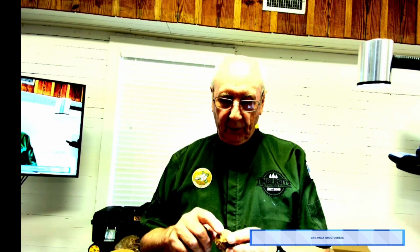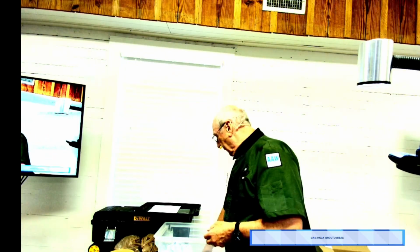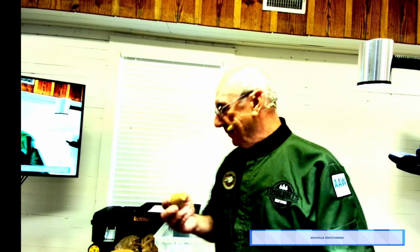But I was going to take this one and dry brush it. I'd done all the texture on it, playing around with it. But one of the things you have to watch out for is make sure you know where your bottom is. Otherwise, it's very easy to make a funnel. You can see the pinhole here. I had it done. It was a nice shape. I was happy with it and parted it off a little bit too short. So,